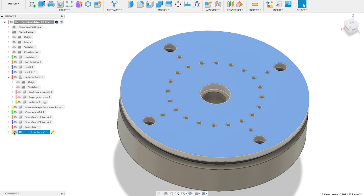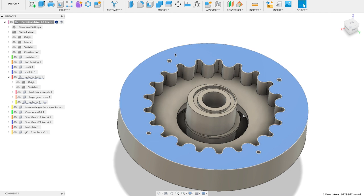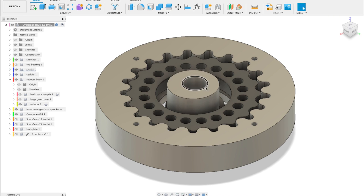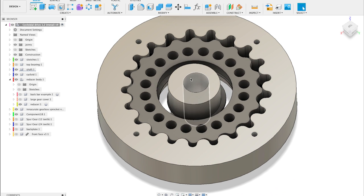I'm going to be machining the front face, adding the bearing, machining the cycloid and the reducer body, and the eccentric shaft that makes the whole mechanism work. The eccentric cam with an eccentricity of 2 millimeters will make the cycloid walk along the housing, meaning one rotation of the cam results in one tooth of movement — giving a reduction of 20 to 1. So 20 rotations on the cam will make the cycloid rotate fully once.